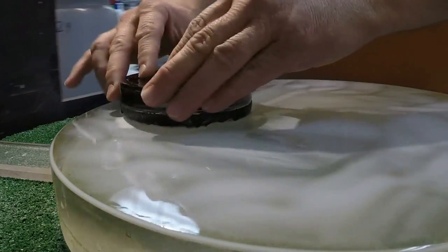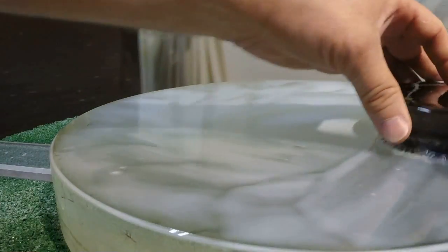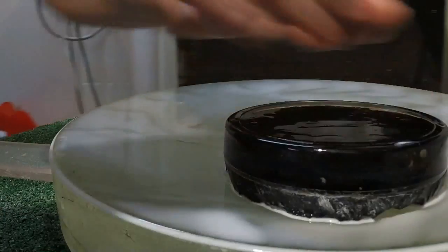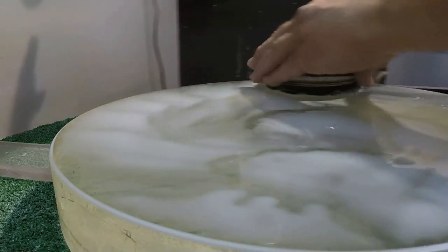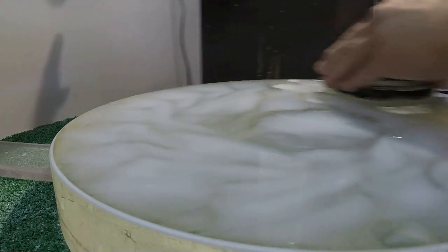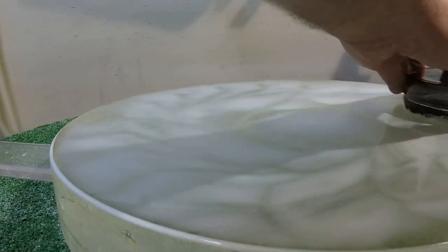The trick to this is you really don't want the strokes to be precise — it's not like every stroke has to be identical. Even your count, if you miss it and do five instead of four, that's not an issue. That little bit of randomness isn't going to hurt anything. The effect is that the off-direction strokes get rid of some of the rough marks you're putting into the mirror. So it's a nice technique because you're solving two problems at the same time on the surface, and reducing the roughness you'd normally kick up if you worked the two radii separately.